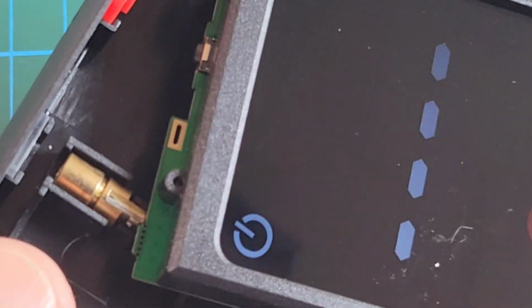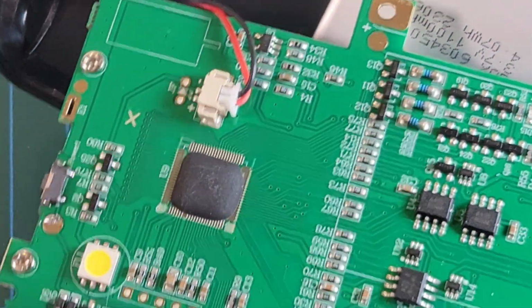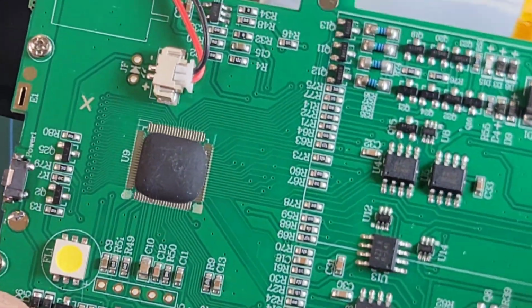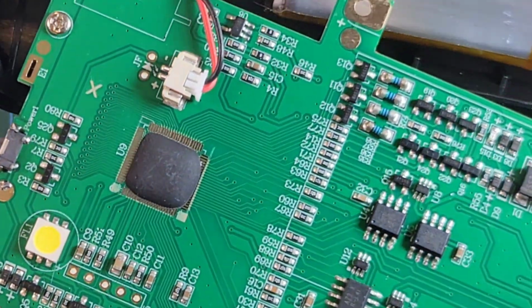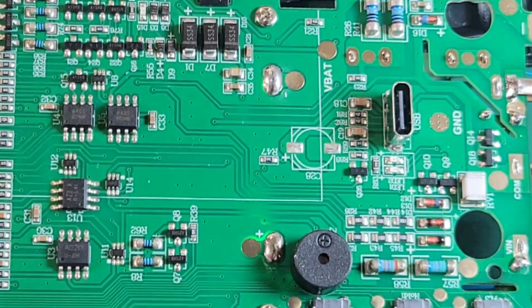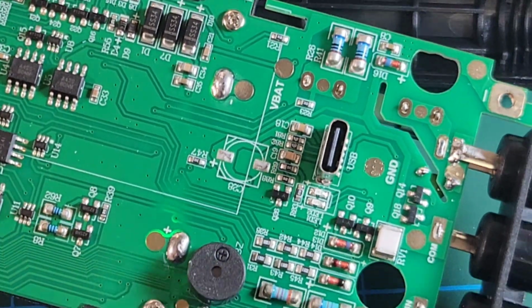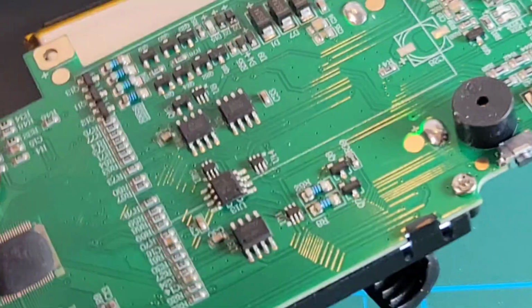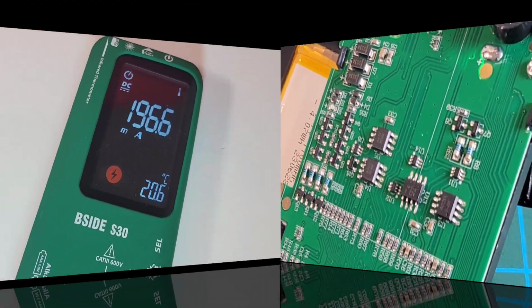And by the way, in terms of NCV itself, I don't see any filament or any protrusion, nothing that would indicate anything is being utilized here externally for some sort of a non-contact voltage antenna. Nothing. Anyway, there you have it. Nice and clean. No flux. It is definitely a clean, well laid out PCB. All right, let's put it back together. Come back with my closing thoughts.